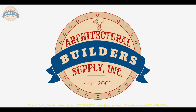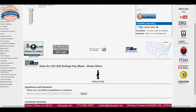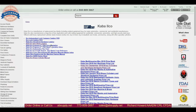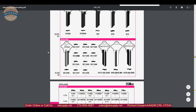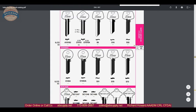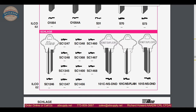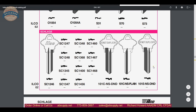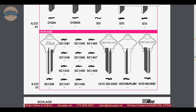Let's switch to the screen view so we can take a look at that now. This is the page we are looking at and the catalog link to the manufacturer's page is found here. When that comes up you are looking for the key blank catalog. I have that catalog loaded — it is on Section 2, page 63. Section 2 is the second section in the catalog for North American Cylinders, and page 63 is where we can look at all of these restricted key blanks from Kaba Ilco. We are dealing with the SC-1248, and what is nice about this is it is going to give you a broaching profile.